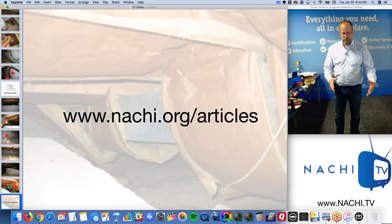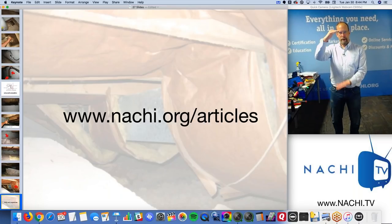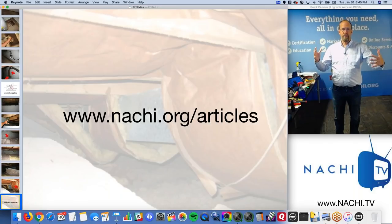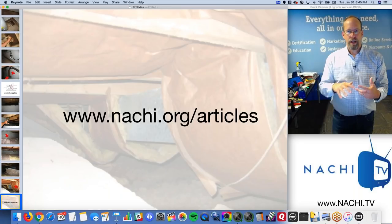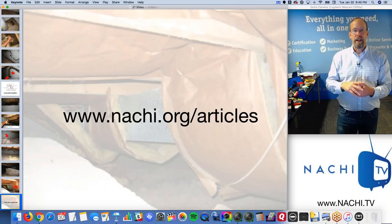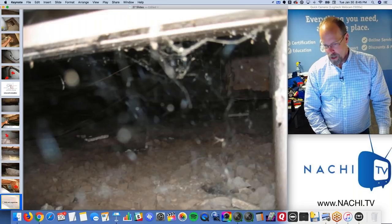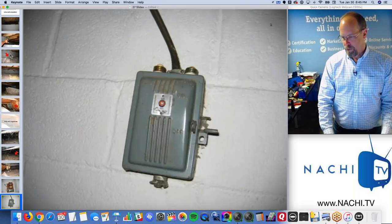We're all moving towards treating a crawl space like a basement, a short basement. No exposed dirt, insulation, and no ventilation, but conditioned air. So that's ideal where you want to go. You want to think of a crawl space as a short basement room, right? However the basement room is, that's how the crawl space should be. That's the general idea, building science principle.